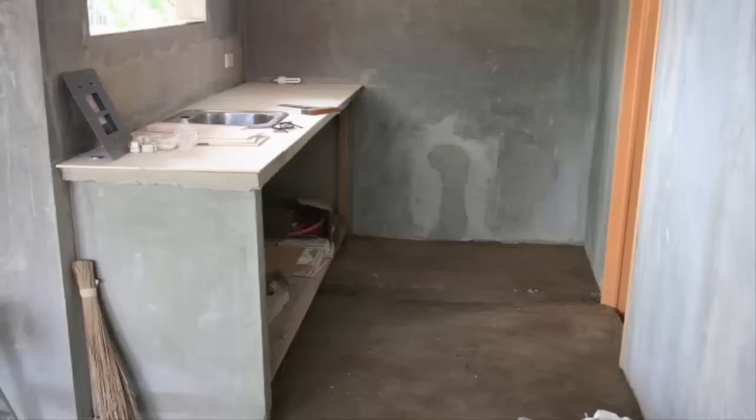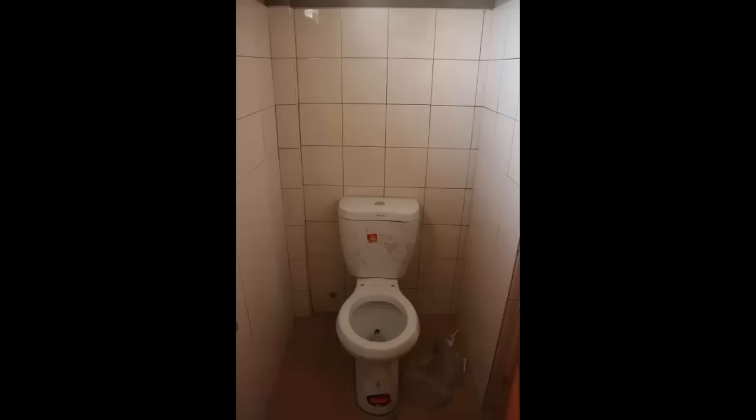A brand new mahogany front door is going in and we are just waiting for the window guys to arrive. We installed a traditional concrete kitchen, which is basically formed over rebar — I have another video on that which I will add later. A warning for others: if the guy doing your openings for the windows isn't the guy fitting the windows, there is a good chance they won't be formed properly. I spent ages redoing all the cement and concrete for the windows because they were so badly made.